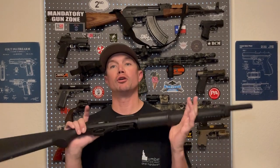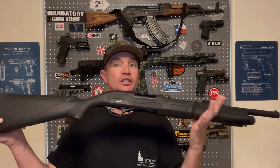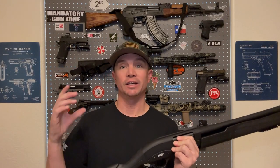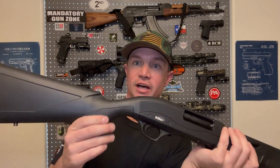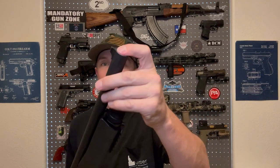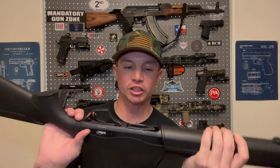If you've followed this series, you know how the process goes. First thing we're going to do is wipe this down — make sure we get any excess oil, grease, carbon fouling, stuff like that off of it, just so that it's clean before we paint. Then we're going to tape off some parts of the gun. Generally, I don't tape off much these days — obviously the lens of your light, optic lenses, things like that. I usually don't like to paint the pistol grip. On a shotgun like this, we're not going to tape off much. I might tape off the trigger, maybe part of the grip, the rubber butt pad, just because I think the paint will come off that pretty easily anyway. We're going to put some tape over the end of the muzzle to not get paint in there. We're also going to put tape over the ejection port and the loading gate.